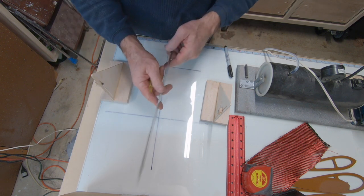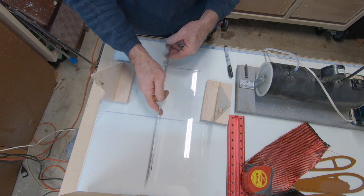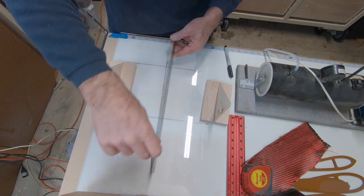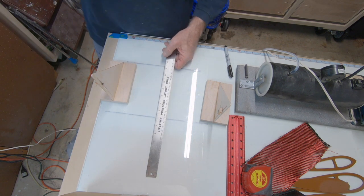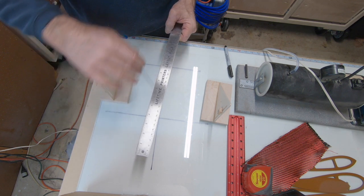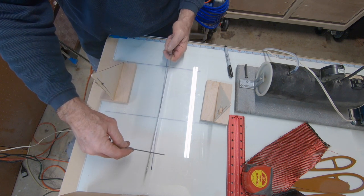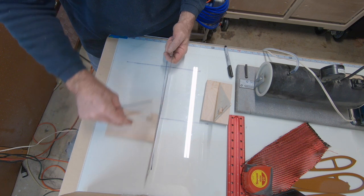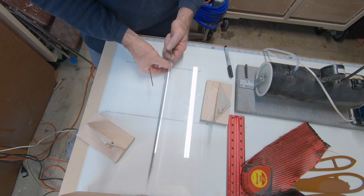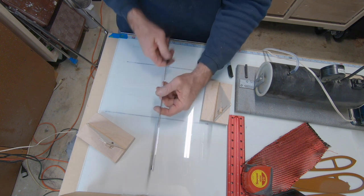So you'll take the fuse and you'll set it on a crutch. You're going to have to jig it up somewhere, and you're going to establish the thrust line. You've got the thrust line and then a datum line down the fuse. I can't really say center because there's nothing in the fuse that's centered. It's just a datum line on your top block, let's say. So you make sure that that fuse is exactly where you want it with one of these gauges. And then you set another block, it's adjustable back here, to prop the tail up. So you get the fuse set exactly on this line, and then you get it the right height, okay?